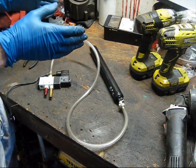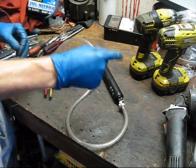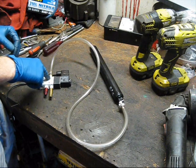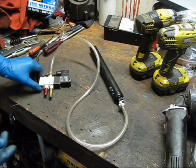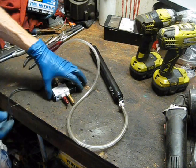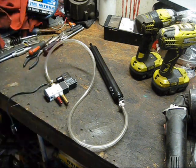You don't need a whole lot of pressure to actuate these things. If you want to get it to actuate faster, you can play with the pressure or use a larger tube between the valve and the cylinder. But that does it — it's a cheap, fairly easy, simple, and very effective pneumatic cylinder made with just stuff you can order or find off the shelf.